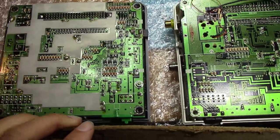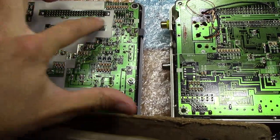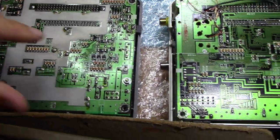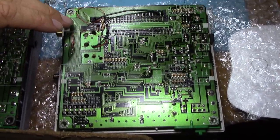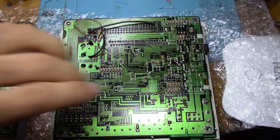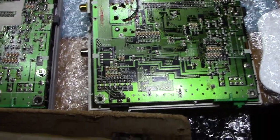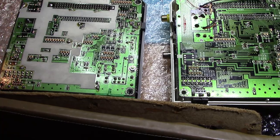What's also really impressive is that you have this shielding here, and this kind of caught my eye right away — it's pretty cool. It's grounded here and also down here, and it's being used very clearly to ground the data signals running from the main CPU and the equivalent GPU and all that. Very cool stuff. They really put some thought into it, making sure that interference doesn't become a problem.